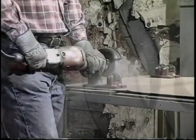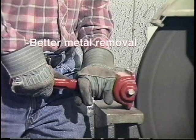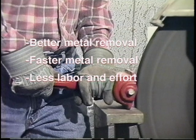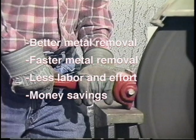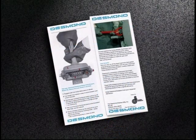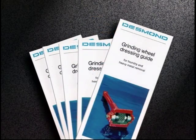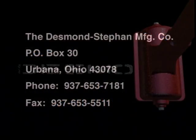Here's a quick review. The proper use of Desmond grinding wheel dressers will significantly benefit any foundry. Stand grinders will operate better. Snagging and other grinding will be faster. Sharp wheels require less labor, effort, and power. You may save up to one third of the cost of metal removal if operators dress wheels regularly. An informative folder is available describing the various foundry grinding wheel dressers and their use. You may want to order some for your foundry education program. Request free copies today.